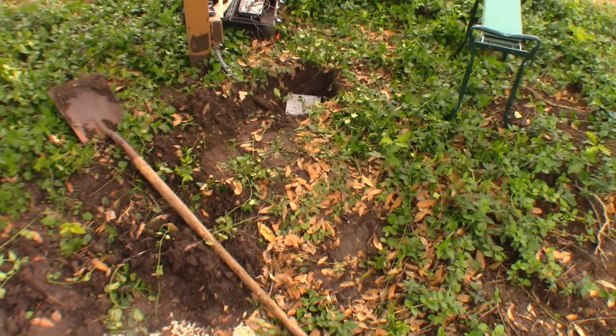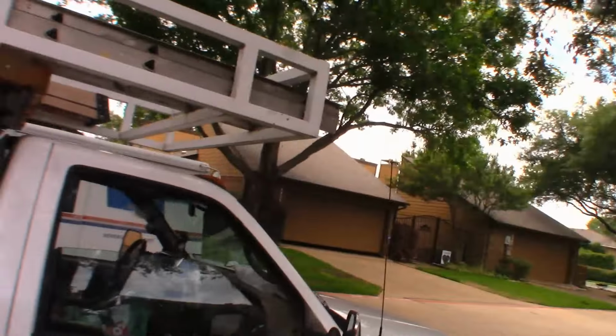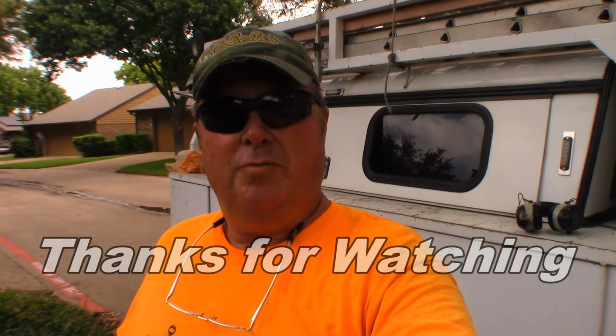We ran a new wire up into the box that's on the side of the pole. Someone had put an extension cord wire, and the insulation on that wire was actually starting to crack off of it in the 2x4 box that's on the side of the pole light. So I needed to go ahead and pull a new wire there, put a new stranded 12 gauge wire in there, put underground wire nuts that have like a silicone inside them, and she's fixed up now and she's good to go. Right there, lights on. My customer will be happy.